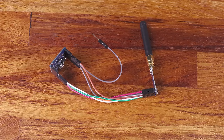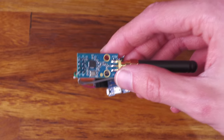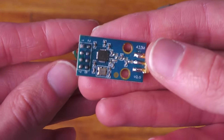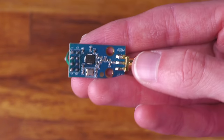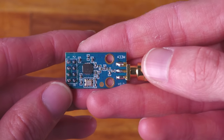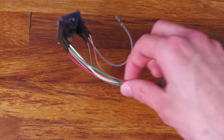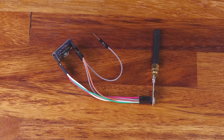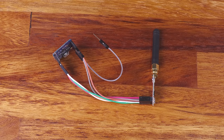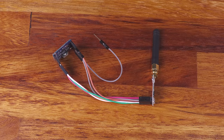For this I've used a library called RadioLib, which is absolutely excellent because it massively abstracts the logic used to control this module. Without it I'd have to read all the data sheets and basically write my own custom driver. If you're doing this and can't get this particular module, I'd definitely make sure you get one compatible with RadioLib. There's also a random wire floating off it - this is a GPIO pin that if connected to ground starts up a configuration mode to change Wi-Fi connection details, using a library called IoT WebConf.